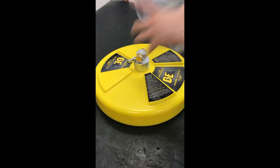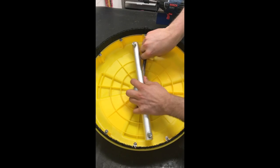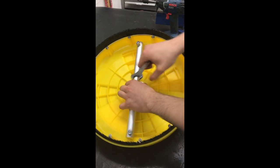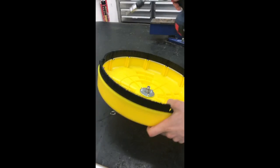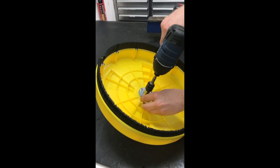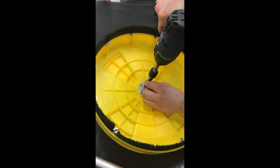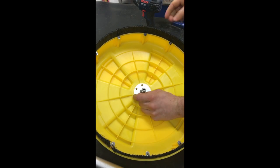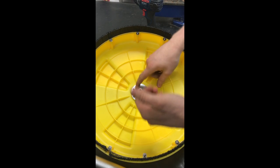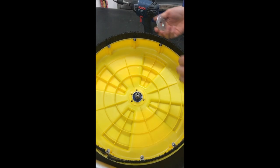You need a 14mm spanner and a 5mm hex key. The first thing you want to do is remove the rotor arm. You've got three allen-headed bolts, and that fourth small hole you can see is your telltale hole or bypass hole — so if the seals fail in the head unit you'll get water coming out of this, and the head unit won't spin properly.